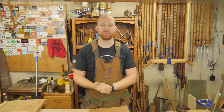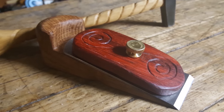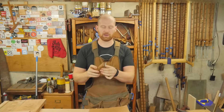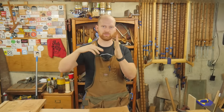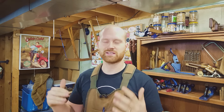This last week has been another great week — a couple good videos came out. I did a video on a chisel plane. This is not that chisel plane, because I've actually sent that one off to its new owner, and this one I'm going to be doing here sometime soon. A chisel plane is a fun tool — great for getting into corners, anytime you have a joint and want to plane all the way up against it. It's also great for glue removal, getting right up to the edge where there's drip-out. Fantastic for getting into corners.